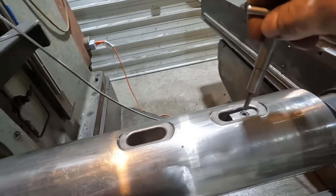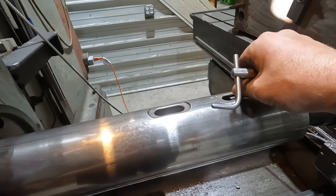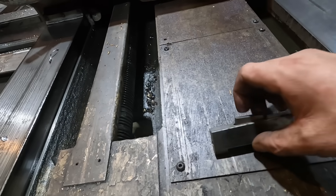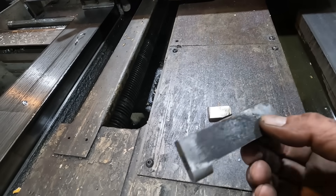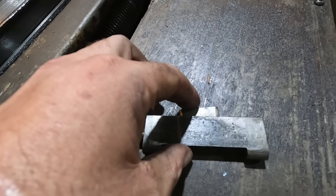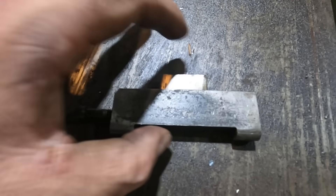There's been a lot of interest in this boring mill draw key that I made, so let's pull it out so you guys can take a look. Basically, the way this one's set up, I've got to back this screw out and then just give it a tap and it falls right out — releases. It's pretty basic: there's a wedge here, and there's another wedge inside that goes in this end, and a bolt threaded the full length to pull it. So as you tighten the bolt, it draws that wedge and pushes it out. Simple as that — works extremely well.